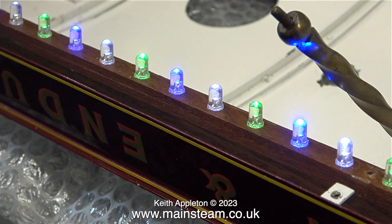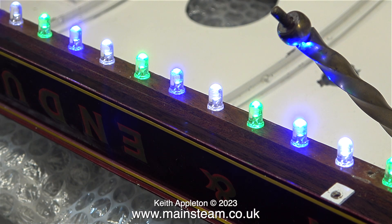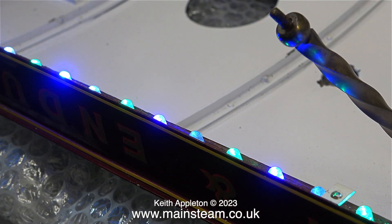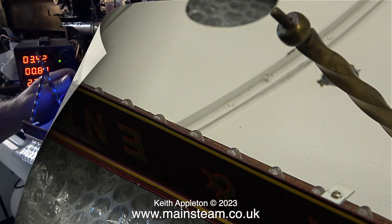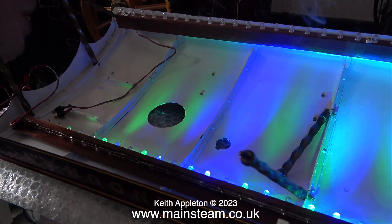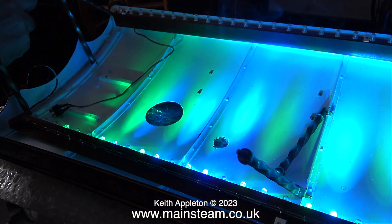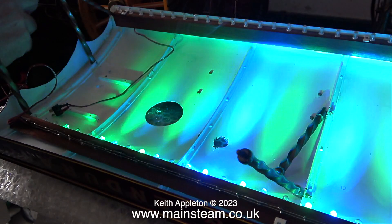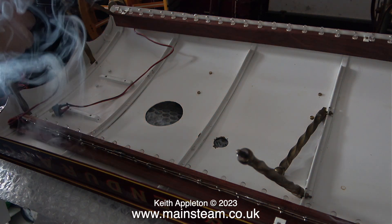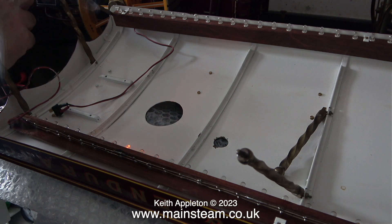Maybe a bit too brightly. The dynamo on the engine gives from 6 volts to 30 volts, and the LEDs would normally not even glow this brightly when the engine was running at high speed driving the dynamo. By overpowering the LEDs slightly, two of them have gone. I'm currently supplying about three and a half volts — and don't forget, these are not fitted with resistors. As I turned up the power, they started flickering, making funny noises, and burning. The reaction was quite alarming with a bit of fire, and there's now quite a pungent smell in my workshop.